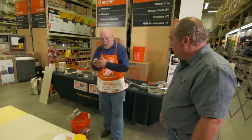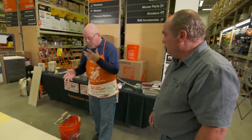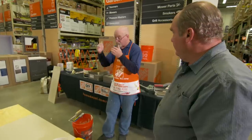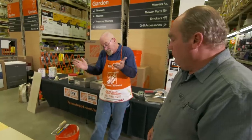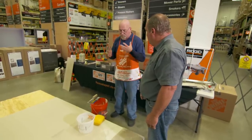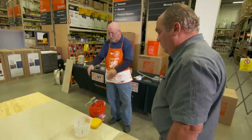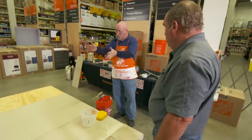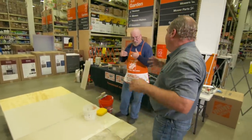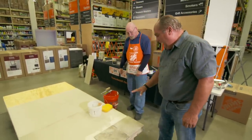There are more tips at homedepot.com in their tiling videos. Centering in the room is something a lot of people struggle with — you find the center of the room, snap two lines, and work away from there in a bigger room. It's also about perspective: figure out where you'll most likely enter the room, and lay tile relative to that entry point. If you have plank tiles, run them away from you to make the room look bigger — long rectangles running away from the doorway, like stripes, give the impression of a larger room.